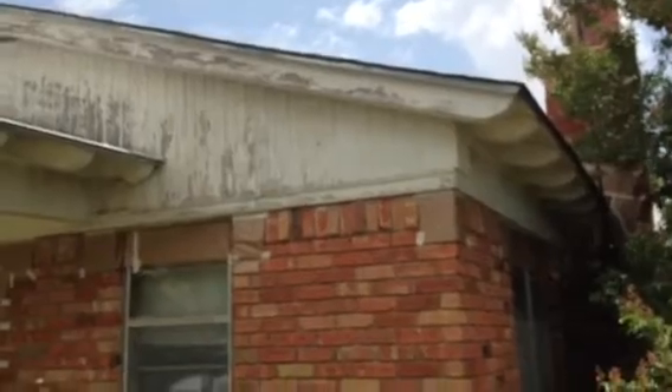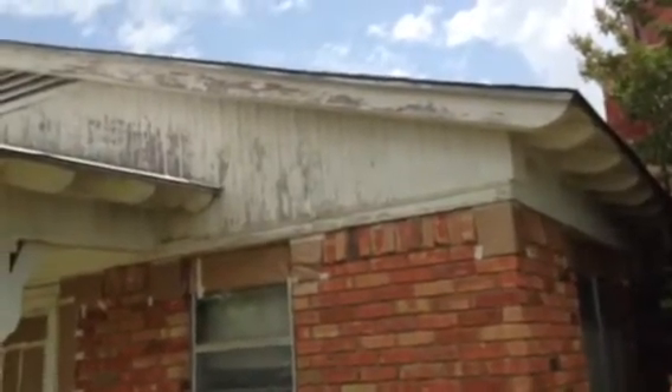Now let's look at the rest of this house. Up here, all of this siding has been power washed, scraped, and now it has been primer sealed with that product — and it looks fantastic. Everywhere on this house. I personally checked this whole house closely and found maybe 20 areas that need more attention because the paint was peeling up on the edges. But to have all of this paint here with the primer holding it all down and no edges peeling up is really absolutely fantastic.